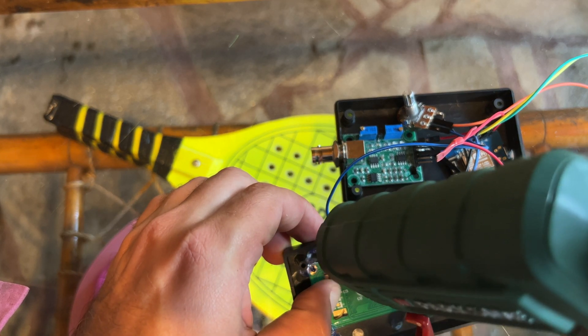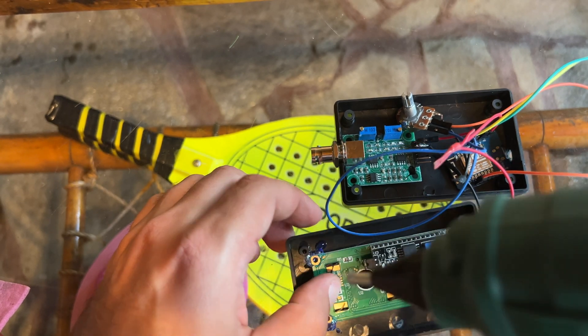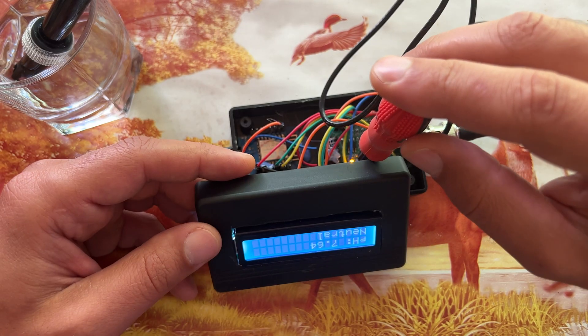Optionally you'll also need a hot glue gun to glue everything in place. The needed parts are not so expensive — they cost me around 25 US dollars in total, but you can check the current prices in the links under the video. Now that we've seen all of the needed things, I'll try to give you clear instructions on how to connect the parts, then how to upload the ESPHome software on the pH sensor brain — the D1 Mini — then how to calibrate the pH sensor, and finally how to add everything in Home Assistant. Let's start.